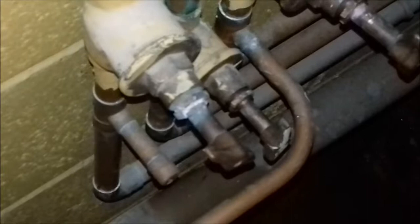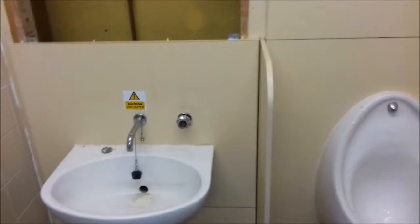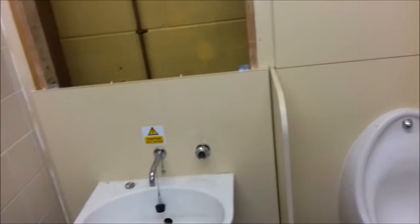I'll come back and check on it later. What I tend to do when I'm doing any sort of plumbing work is go back and check it after a while - if it's going to leak you normally spot it pretty early on. I'll leave it open and come back an hour or two from now. I'll dry that all off with some tissue, then run my hand under there to make sure it's definitely not leaking before you put the cover back on, because once you seal it all back up a tiny leak could be going for years and you probably wouldn't know about it. Always best to double check.